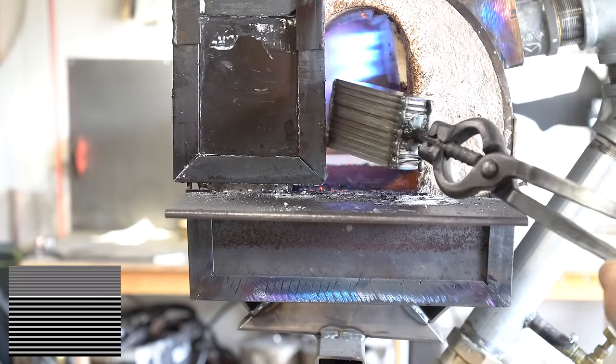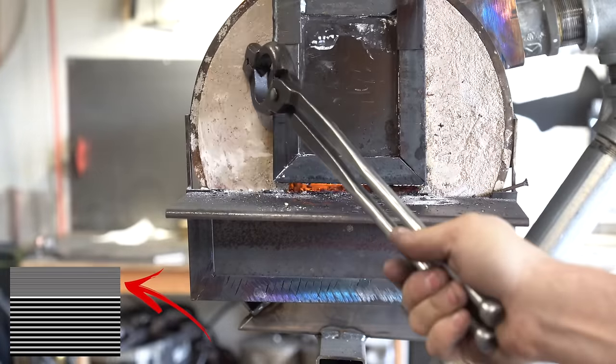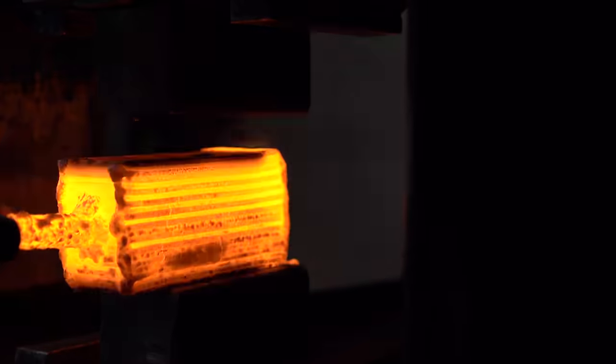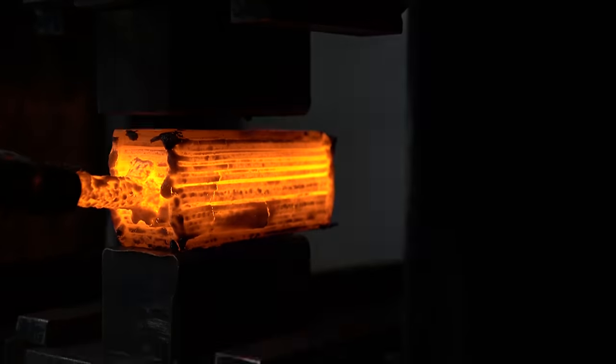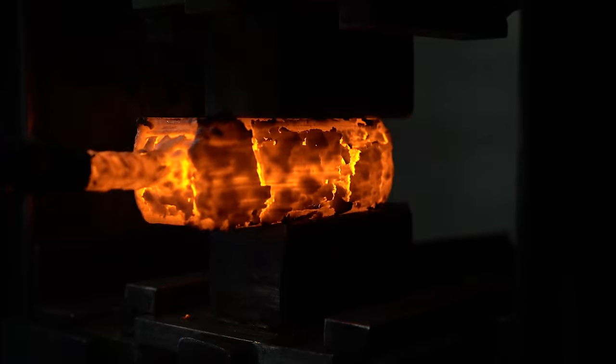To make things go faster at Rick's place, I'm going to be forging a piece of Damascus at home. I've got a stack of 25 layers of alternating 1084 and 15N20 steels. We're going to forge-weld these together, draw them out, and then restack because we need about a hundred layers.